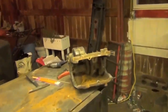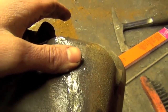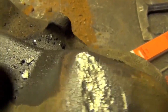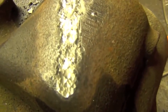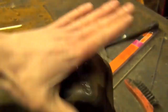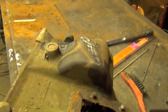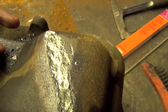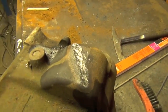Alright ladies and gentlemen, let's come over here and have a look at the final outcome. As you can see, it's completely cool to the touch and it's all in one piece - there's no cracking or nothing. We do have some little metal chips of nickel electrode and gray cast base metal everywhere; that air hammer kind of sends them flying a little bit. Just looking at this weld, it's definitely pretty well hammered into submission. It's a little bit on the concave side, a little bit low - I would probably want to give this thing another pass, but realistically that's a personal choice. I don't doubt this thing would hold gear oil. As you can see, we did no pre-heat, we did no post-heat, and it worked. If I was preparing this for a customer, I'd put that extra pass on there, then grind it smooth and call it a day.